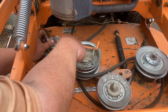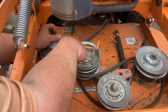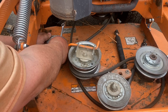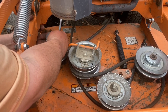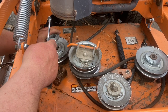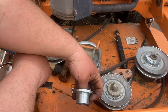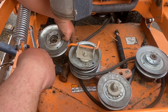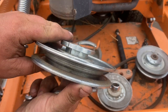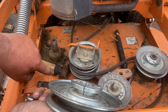Well, not quite — I've got to get this part off. It typically isn't all that hard. I always replace all the hardware when I mess with a taper lock pulley. So if you didn't know, all it is is a slight taper with a split in it. As it's compressed down in there, this split shrinks and clamps onto that shaft.